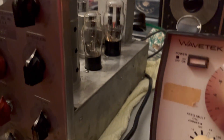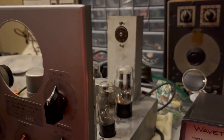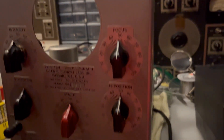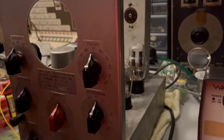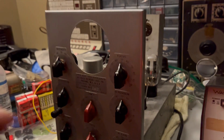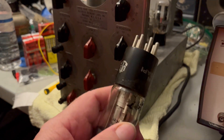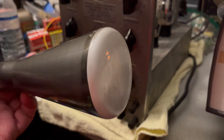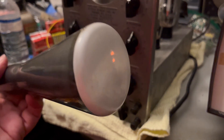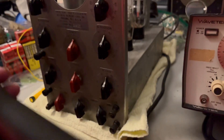I've started to clean the inside a little bit, cleaned off all the tubes, and I'm going to try to buff it out a little more. Unfortunately, as much as I would like to bring this back as original as possible, the CRT is actually broken — I have it right here. It's broken here — they don't really have a good way to cinch it down. I don't know if somebody broke it or moved it and it broke, but you can hear it squeak in there. At first I could get a signal and then the signal would drop out, so it wasn't working very well but it was working. Eventually it stopped working altogether.